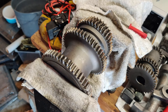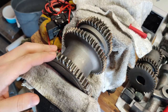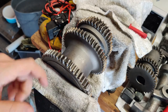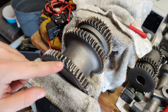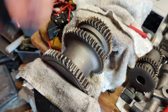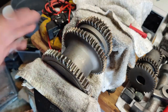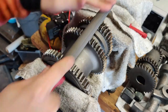Welcome back. Not too much needs to go into this video. Working on the repair - as you can see, I took where the teeth were missing and just built up a weld. Hopefully the bead is large enough to get the full tooth form out of it. I've already done two of the other ones - you can see one down here and the other one's all the way on the other side. They seem to be coming out pretty well, so I just need to take this file down the tops like this.